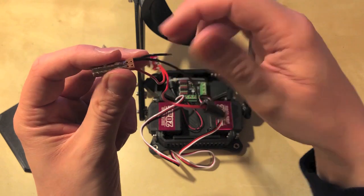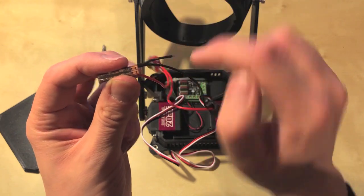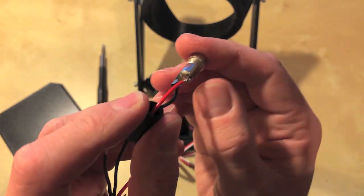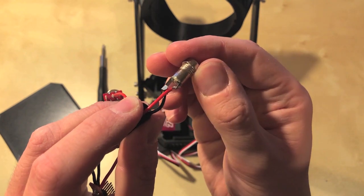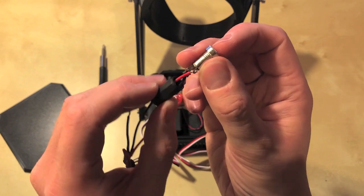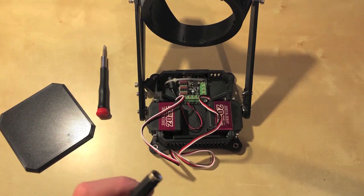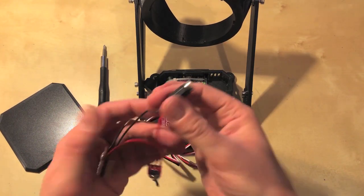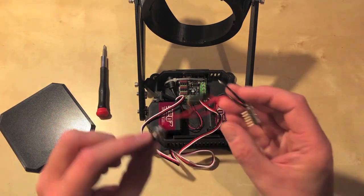Ground goes to the other pin rail, and there's also a ground lead that sticks out — I'll show you what that's for. One important note: for most power supplies the centre pin is positive and the outside is ground, but I've already had one patron blow up a Romeo by buying a supply that does it the other way around. So the best thing you can do if you're unsure is get a multimeter and check which terminal is positive before connecting anything.